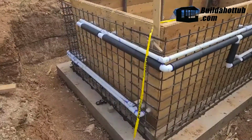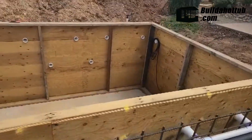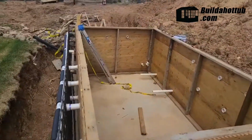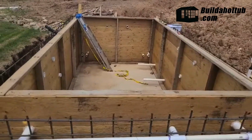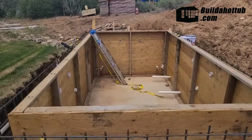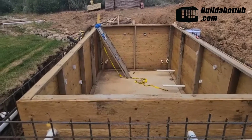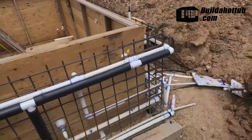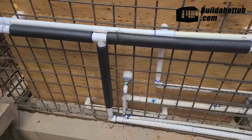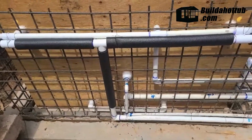You can see the back side here. Show you while I'm here if I can lean over. I can't see from the side. So down in the bottom there at the back, you can see 3 dead-ended pipes on both sides. Those are actually 1.5 and 2-inch pipes coming in that are going to feed gunite bodies that are going to be built into the seats on the interior. So those will be plumbed out later. And right there is the light going through there in the center. That's a 3.5 or 4-inch downsize to 1-inch with the cable running through it for the pool light, 12 volt.